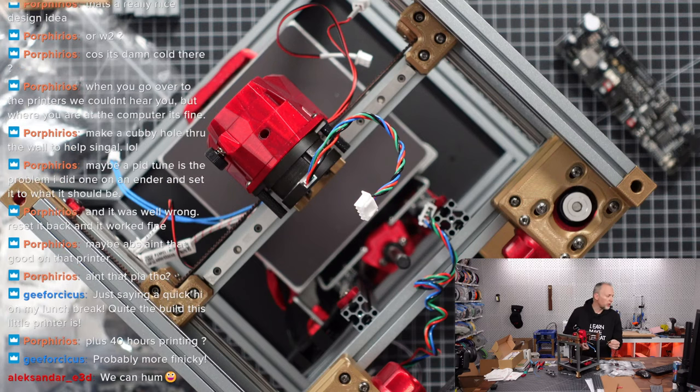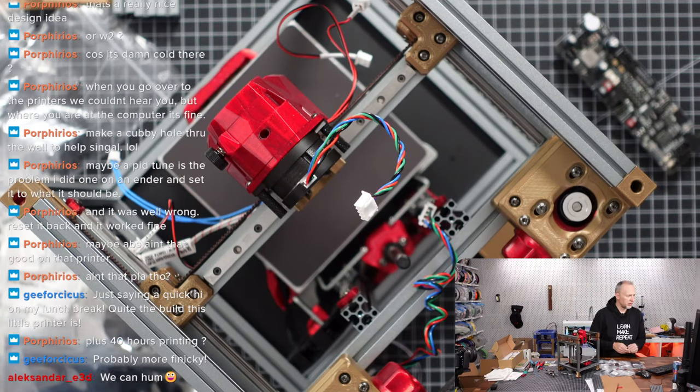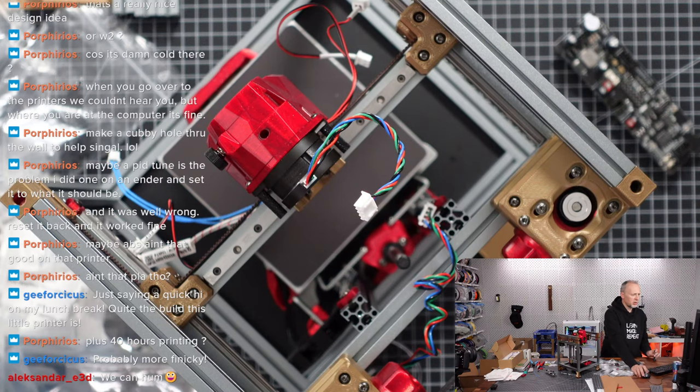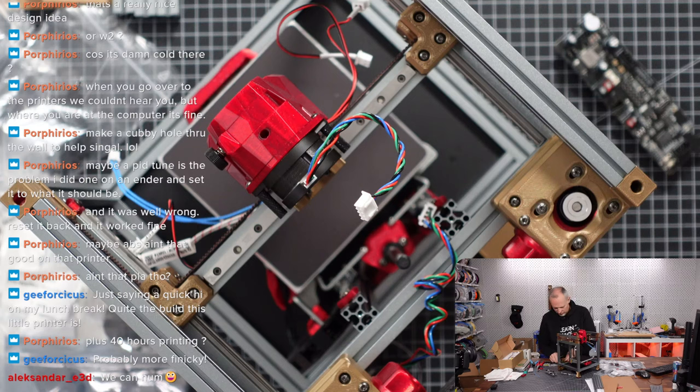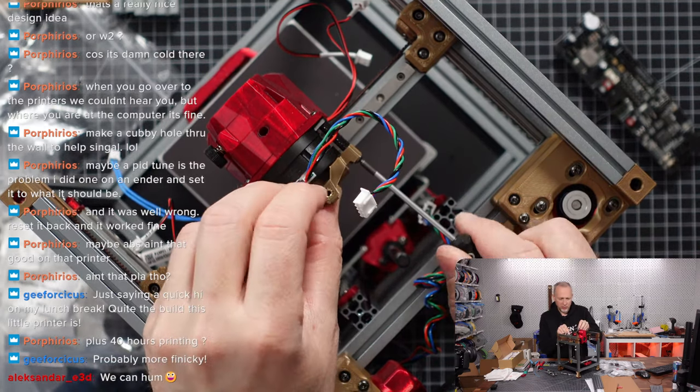Is it the right orientation? Is this too short? M3x8? It's too short if that's the mount; the hole on top of the screen is relief. Okay, my impression is that M3x8 screws are too short for this purpose. So they're not grabbing.